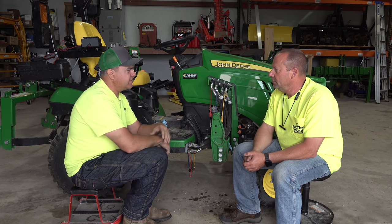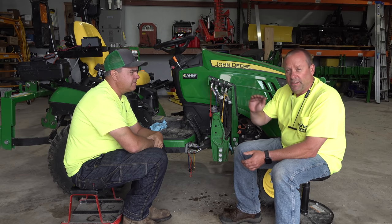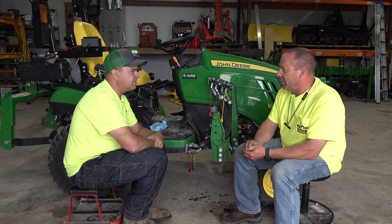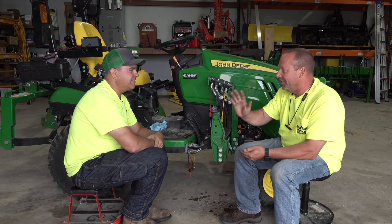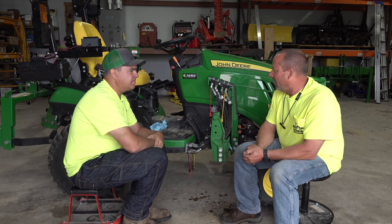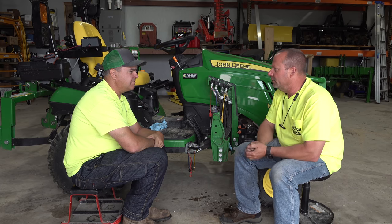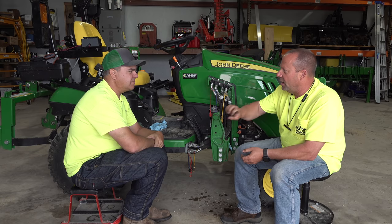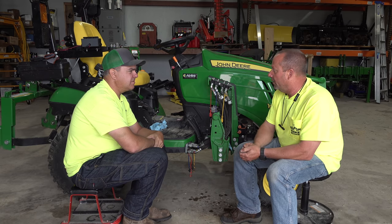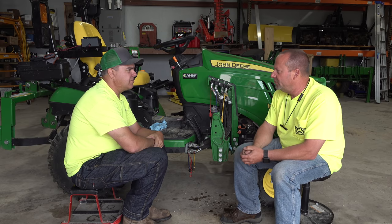It's a little bit hard to see there on the dipstick. On the dipsticks, it's very hard to see, and quite often in the sight glasses, it's hard to see. Especially when you overfill it, you think it's not there yet, but it's way over. So John Deere actually sells a dye that costs about $7 maybe, in a small couple-ounce bottle, and you dump that dye in your hydraulic reservoir, run the tractor, and it turns your fluid red. Makes it super easy to see on the dipstick.